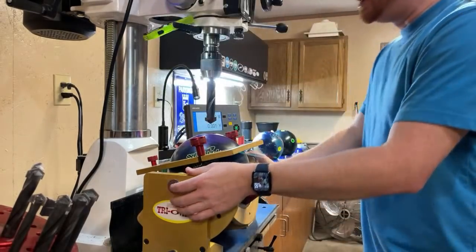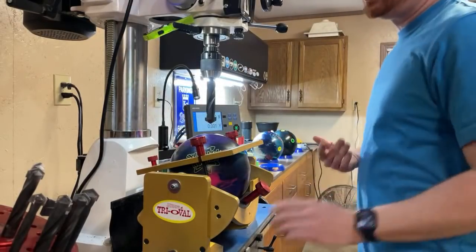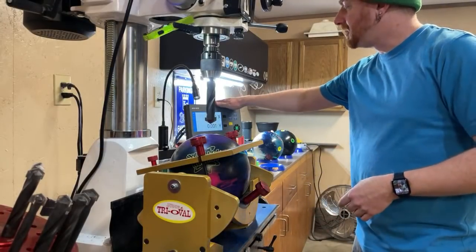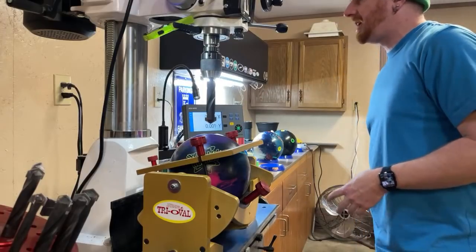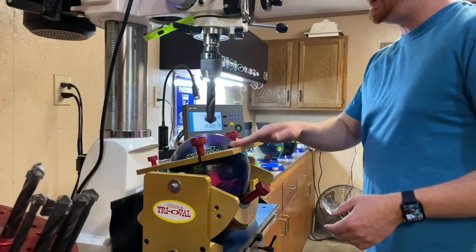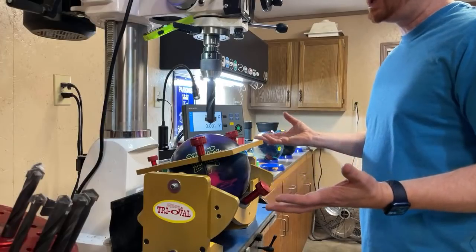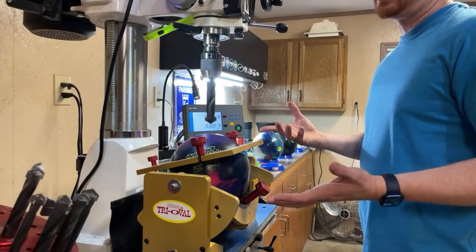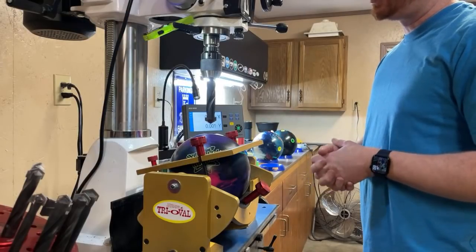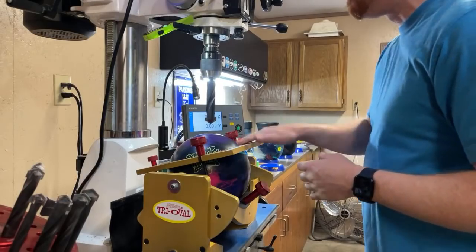the only difficulty when you're doing this sometimes is making sure that you get the pitches right, which we have known pitches to begin with. It's kind of tough sometimes when somebody brings an outside ball into the shop to have re-slugged that wasn't drilled there, because the slug hole may or may not be at the same pitch as the thumb hole. And so all you can do is put the pitch gauge in there and measure what pitch the thumb is at. Sometimes if the slug hole is not the same pitch as the thumb hole, you don't find that out until you're in the middle of doing it.